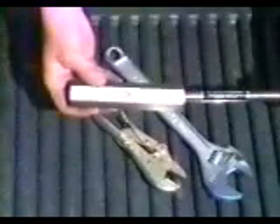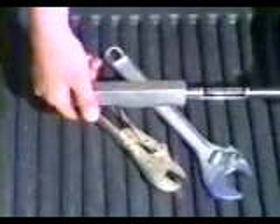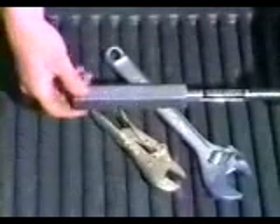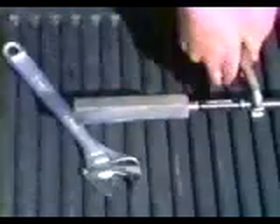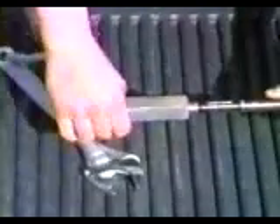Check to see that the adapter is properly installed. Next, attach the 5/8-inch tile probe base section included in your kit to the extension drive adapter. Securely tighten the fitting. It's important throughout assembly that all fittings be tightened securely — this will substantially reduce stripping of your threads during operation.